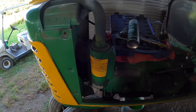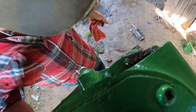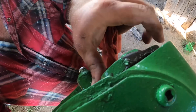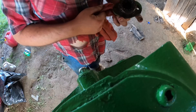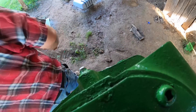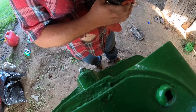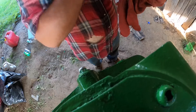Let's get to doing some work. What I have in mind here — well, first I accidentally throw all my fasteners on the ground. What I actually had in mind is to take this rag, put some brake cleaner on it, and wipe up this surface so I don't run the brake clean all over the paint and end up ruining it. Because brake clean and paint don't always play nice, especially paint that is fairly new and probably has not had the full amount of time it would need to cure.